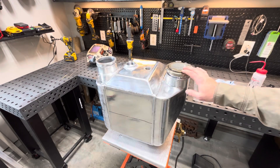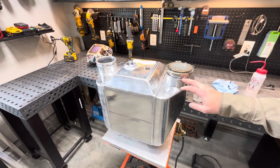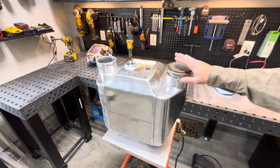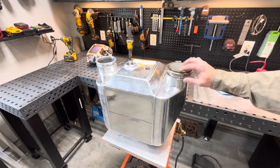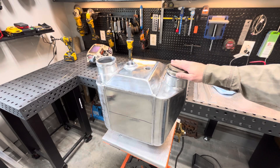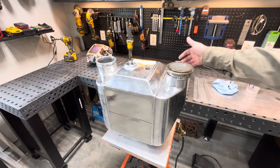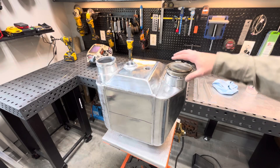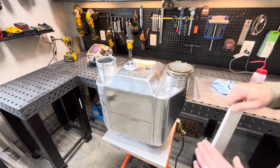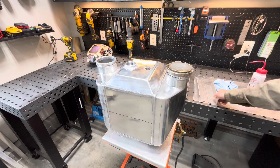We got this intercooler set up here ready to go. We're going to make these two welds on these v-bands. The way I do this is I have a v-band clamp cut down on the back side, and I have a piece I've made here to purge with, with a female v-band welded to it. This is a stainless one so they don't warp as bad. I clamp that on there, we'll do about three quarters of the weld before we have to rotate. We'll let it cool, turn it, do the rest. We're also going to stitch some two-inch angle iron on here for him to mount it in the truck.